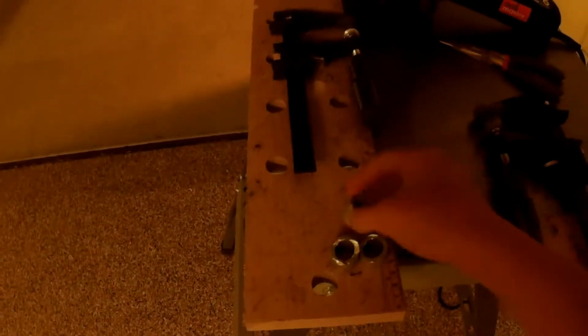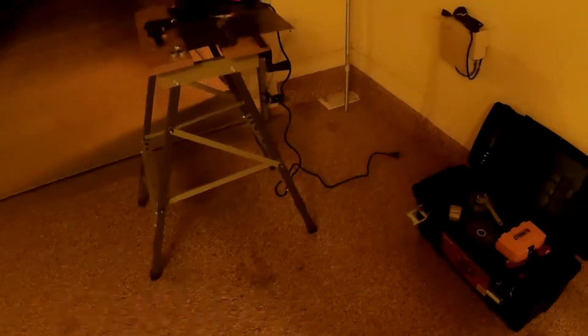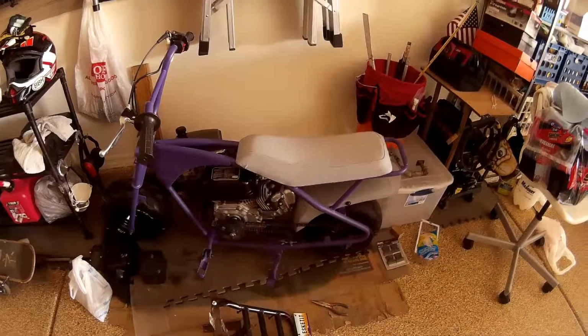So I've got 3 right here. I'm hoping that 3 angled pieces should be enough to make a 90. I'm pretty sure mathematically 3 perfectly cut 15-degree pie cuts will make 90, so hopefully I can make 3 unmeasured ones make 90. So I'm just going to work with that here for a little while, and it's already dark out, so I'm probably just going to continue this tomorrow morning, I guess. So I'll see you guys then.